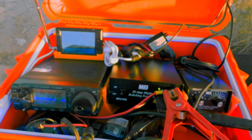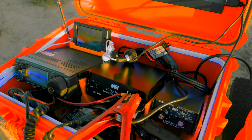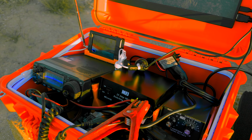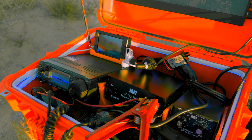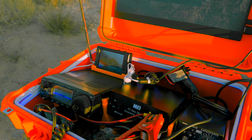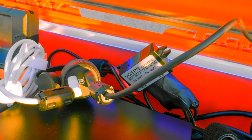The problem is you could just buy the official charging brick or the CanaKit charging brick. But that's AC voltage, and I don't want to run an inverter and waste even more power and add complexity. So you can just make your own charger with a buck converter and some Scotchlocks that are underneath all the gaff tape just to keep it all neat. Not required.